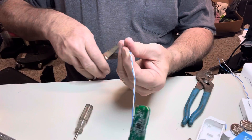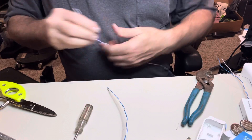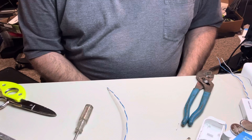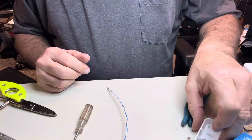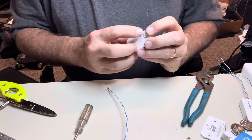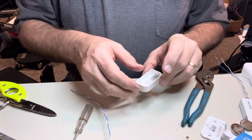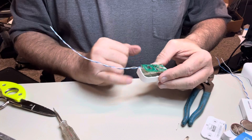I'm going to cut this off about this long, and then I'll run a cat 5 cable from my alarm panel up into the attic where the old alarm panel used to be, and that's what I'll tie these all together with. Now to get that cable out, I'm going with the opposite end from the button — it just seems to work out pretty good.